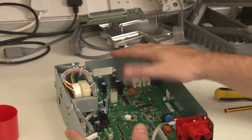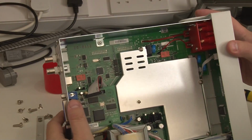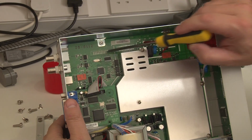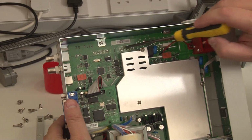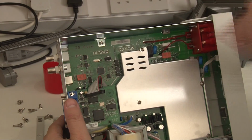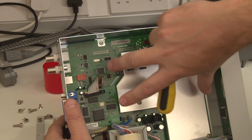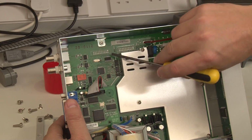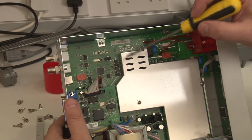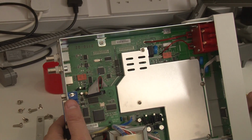All right, so let me put this back together now and power it up and make sure it still works. One other thing I didn't point out here is on this board, right by each microcontroller, you can see that there's these headers here. These look like JTAG headers, so I guess these are programmed in some kind of in-place board mounting thing with all the test pins that just push up here. Obviously, if you wanted to hack this thing, not saying it would even be worth hacking, but if you wanted to, you've got the JTAG headers here, and you can get access to both microcontrollers.